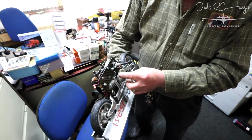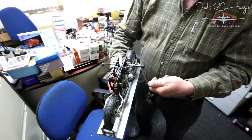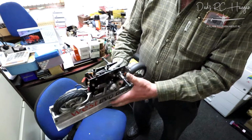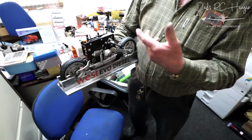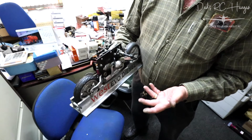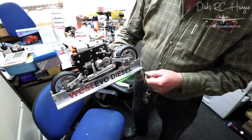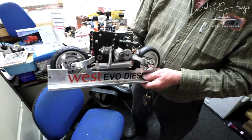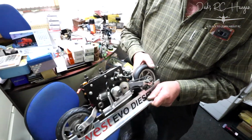Inside the flywheel, you've got the centrifugal clutch, it just pulls it away. But what you've got is easy start. You just put your normal starter cone on there, and away you go. Whereas most people are starting it from behind. So it means you've got more bearings, more junk going around inside the motor. Whereas doing it that way, I did that system originally in the late 60s when I got involved in IC cars.